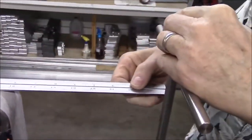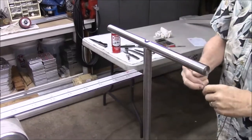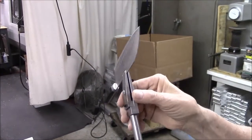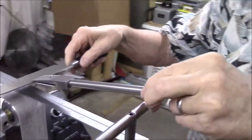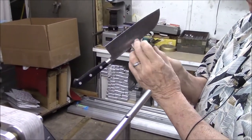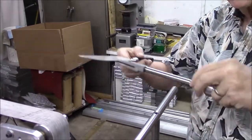Establish the angle by measuring to the top of your bar to the bottom of the scale. I've got that set at 2.65 inches for height. You can adjust this up and down to establish your angle. This is a clamping tool — the cross section is quite thin, there's not a lot of threads, because if we make this big and bulky you can't get your angle on small blades. You don't just wrench this screw down — it's a fine thread. All this does is support it. If you can hold it and twist it, you've tightened it plenty.